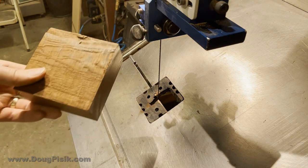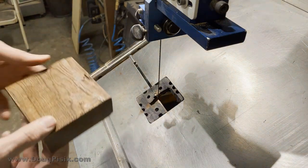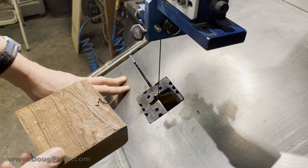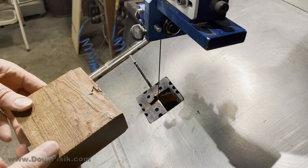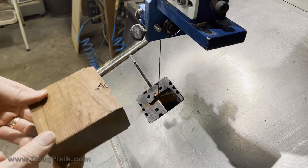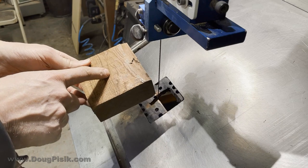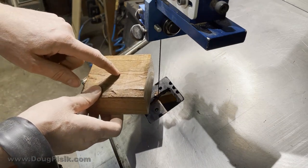Did you know it's possible to cut a cone out of a piece of wood using your bandsaw? You can do so if you have a very thin blade — in this case, an eighth of an inch blade. I've also tipped the table to 45 degrees, though you can tip it to any angle depending on the shape of cone you'd like. To cut it, slide your wood into the blade until it's about halfway through, then rotate using the very tip as a pivot point on top.